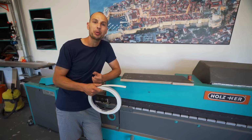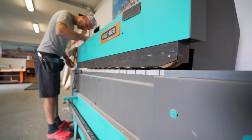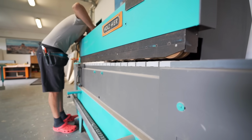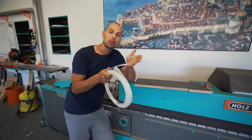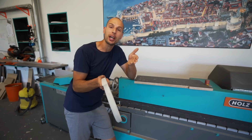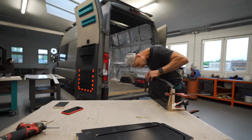This is the single-purpose edgebender device that is fed with any ABS plastic edge or actually a solid wood piece. Then it applies glue and just presses it together, routers a beautiful edge. It's great for straight edges, but for my side panels, it's not gonna work well. I need to do them by hand.